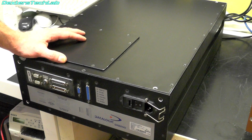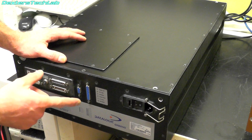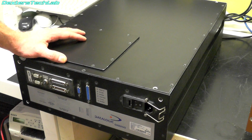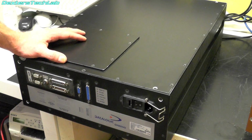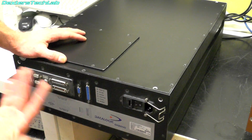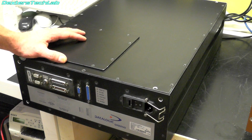I don't know. We've got a number of status lights here: power on, external trigger, I mentioned that before, encoder, not sure what that means, good read, well that's pretty straightforward, so if that comes on then it's obviously read a barcode. TX data is obviously transmitting that barcode data to whatever receives it and processes and makes decisions on that. And we've got a network light as well, so I'm not quite sure how the network works with this because there's no RJ45s that I can see. Maybe we'll learn a little bit when we take this apart.